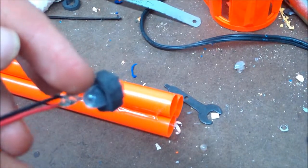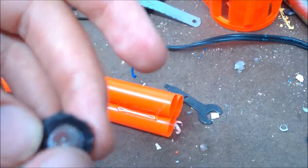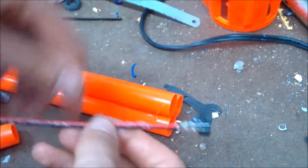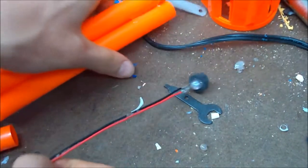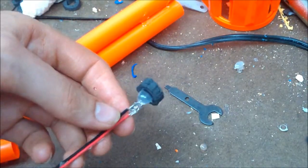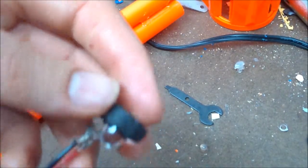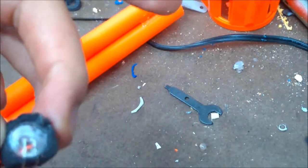It's a giant blue LED, 10mm of course, with nothing more than a standard wire setup with extenders running the full length of the entire system, and a little more so I have room to solder on the other end, and they're carefully glued together all the way down so it's become nice and straight and stiff, and they don't accidentally cross while inside, because this is a one-way deal for me. Also on top I've got a little bit of foam, which I trimmed out of a bigger piece of foam, so that way it fits nicely around the LED and holds it secure in the center.